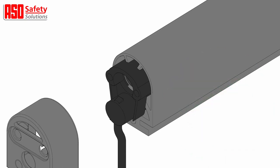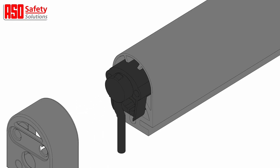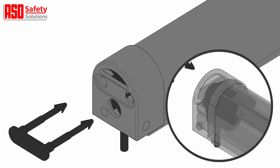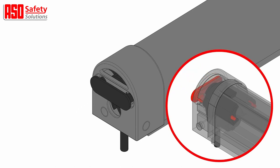Insert the attached KS4 resistor or cable plug into the electrical switching chamber of the safety contact edge. Now press with force on the plug using a thumb to drive the plug into place. Remove the pressure and then press the plug again to ensure the correct fit. Place the end cap neatly over the KS4 plug and lock cap to secure the build.